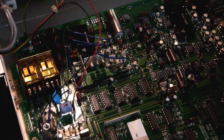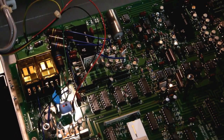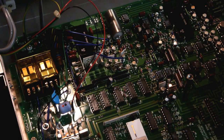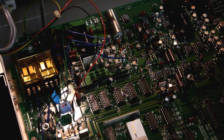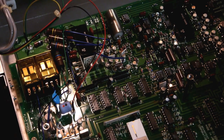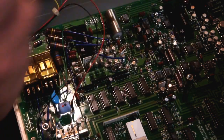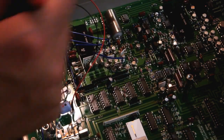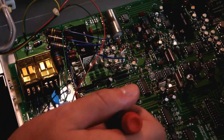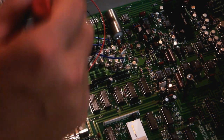We've got these huge resistors. I suspect these are for input protection or something like that. They've also got the high impedance Teflon washers around their connection points. So I'm thinking that this is all the input. And then you've got the input, this green yellow wire go off into this input can, as do the black and red wire, which also come down here to high impedance connections.